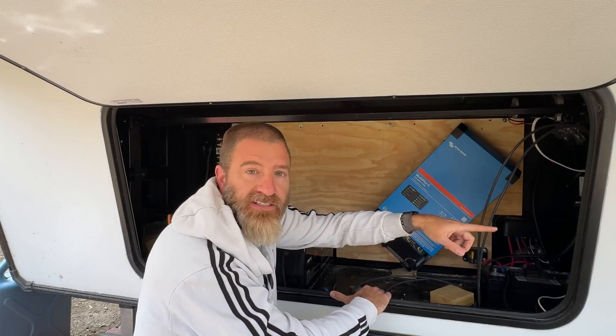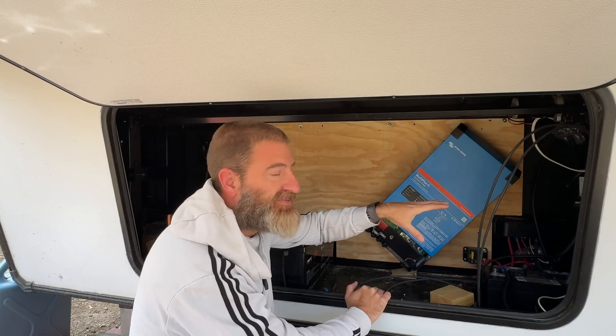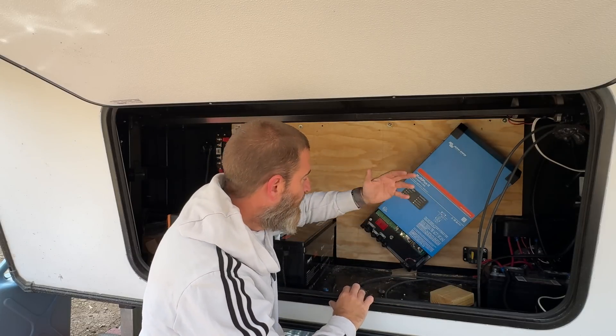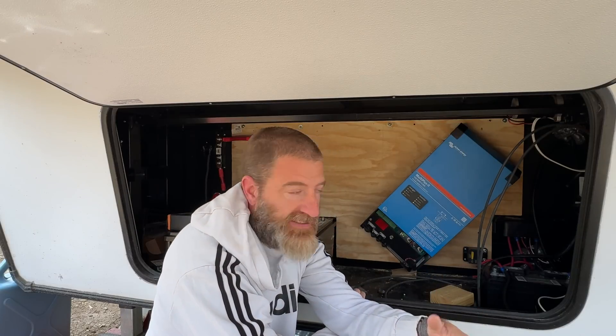The factory battery has a vent up here. I'm going to get a computer fan or small four-inch fan, hook a temp sensor to it, and put an inlet on the other side. So in the summer if this starts getting too hot, I'll pull air through this cavity, and that should naturally pull air up through if I put the other vent at the bottom on the other side. Hopefully that takes care of my ventilation needs. Now I just gotta mount the charge controller.